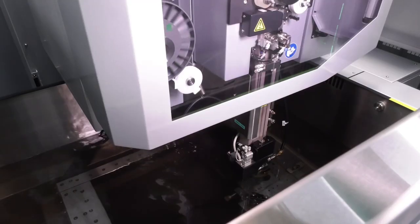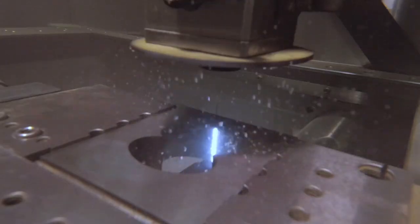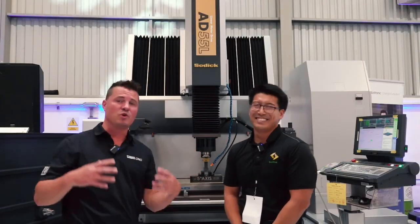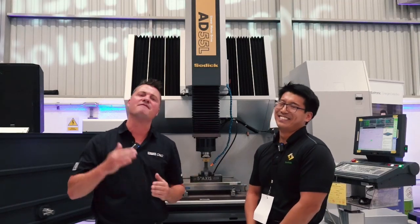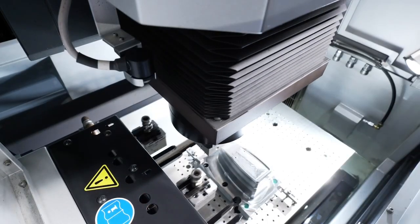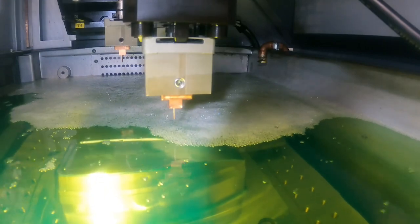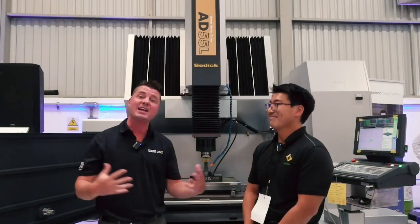You've got to be rotating the wire — you want to use a different piece of wire as we're traveling down the workpiece. It gives you better surface finish, better geometric accuracy, and you're saving money. Who doesn't want to save money? If you have tens, dozens of machines, you're saving money. When we're thinking about investing in quality technology that may cost more up front, think about the money you're putting in your pocket over the years as you continue to invest in yourself and your company. The future of your company and your employees rely on those investments — and that's where Sodick comes into play.